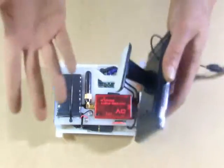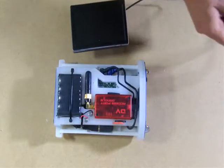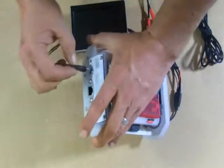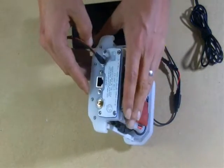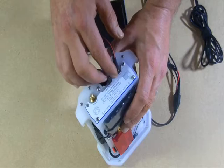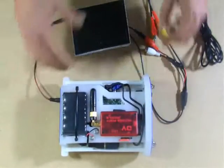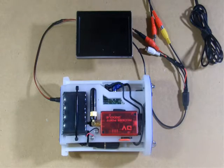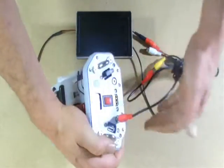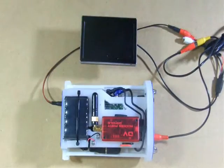This little thing works fine, and I don't think we paid 30 bucks — I think like 27 or 28 dollars for this. We're going to plug the DC power in into the back of the DHAP. This is not only the charging port — since it's a direct wire to the battery bank, it also provides 12 volts out if for some reason you need a small amount of 12-volt power. In this case, we're going to run our monitor off the DHAP while it's running the dongle and the computer. Then we take the RCA video in for our little monitor and plug it into the video out. We could, of course, also choose to use the HDMI port if we had an HDMI unit.